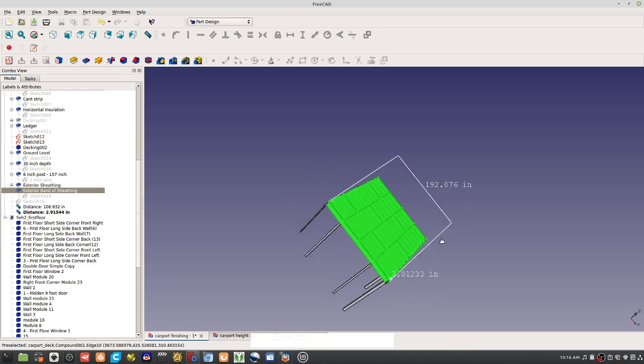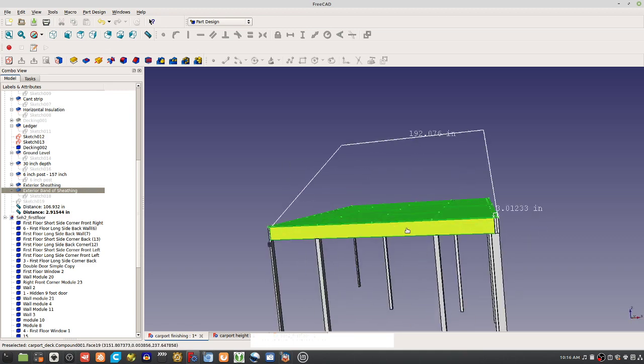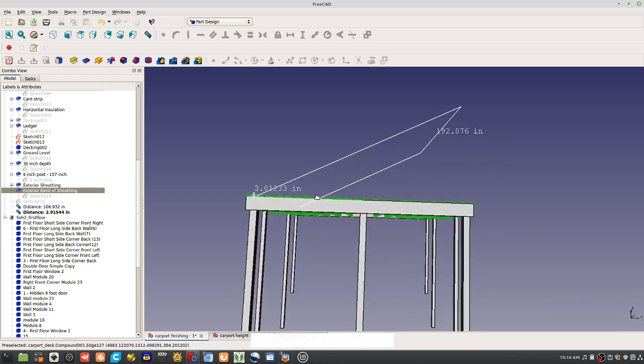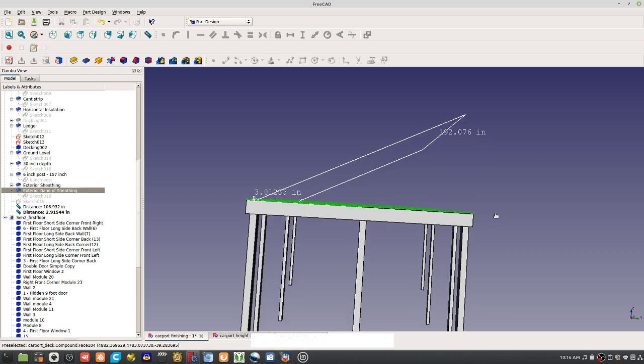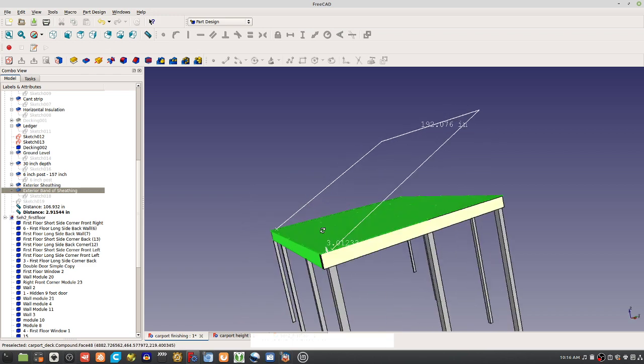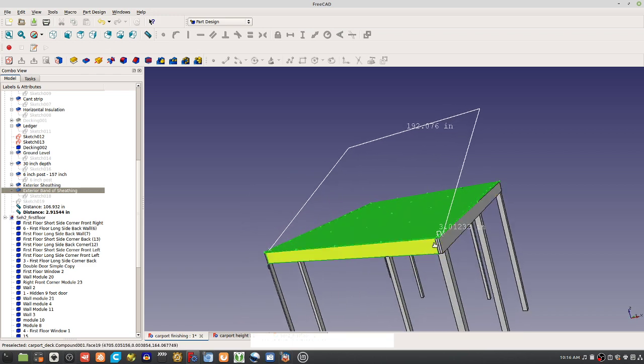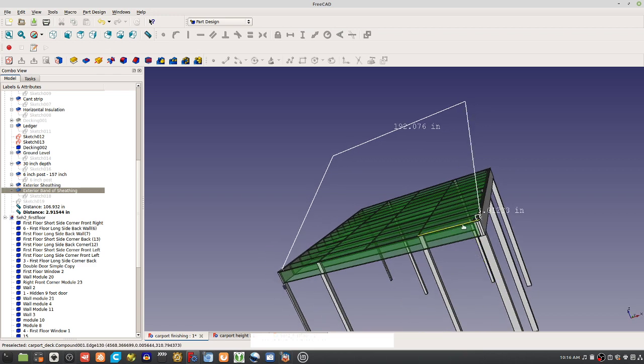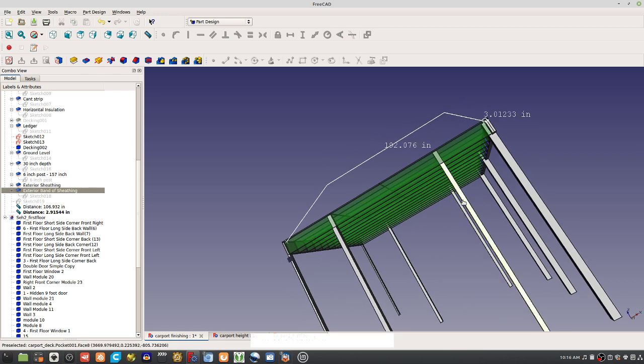And that defines the slope here, but also here, you just take a level to make sure that this is level across, that it's not dropping to any corner. So once we put one joist in, we pretty much define the entire geometry here, which will locate the holes here. And then after that, the 4x4 posts, those we can put in after everything is good.